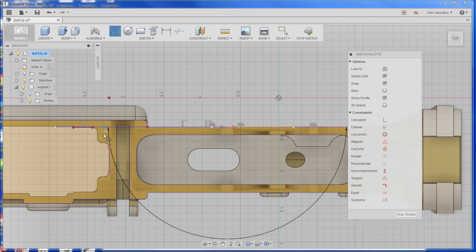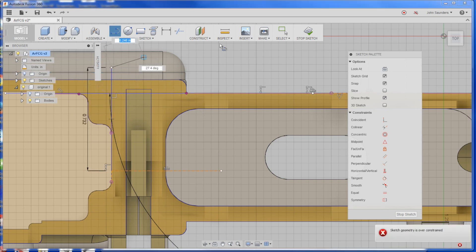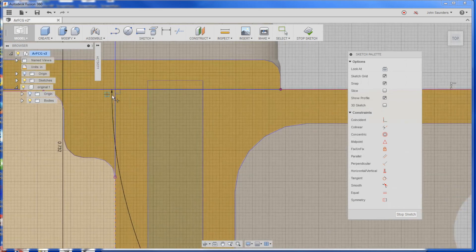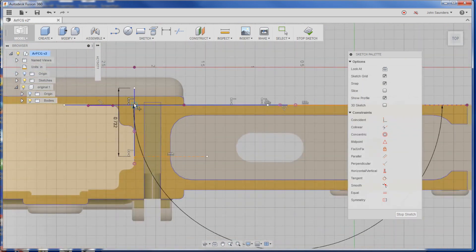Choose Line again and pick this line. We see we're at 90 degrees, which is fine — click Enter. Now we've got these two lines. We can do a Sketch Point, zoom in a little to make it easier, and you can see it snaps to the intersection — and we create a point right there. We'll go in and show how to create the coordinate system in CAM.